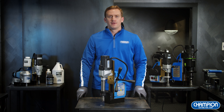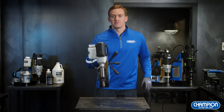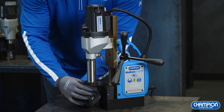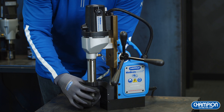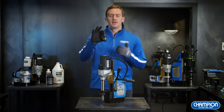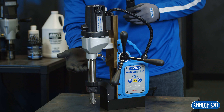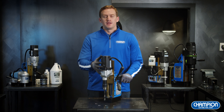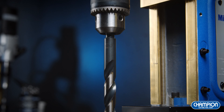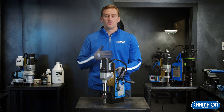Here we have our AC35. The AC35 is one of our best-selling units. It's economical and lightweight at 23 pounds, making it easy to transport around the job site. Another great feature is our Quick Change Arbor, which allows interchanging annular cutters quickly and easily. We also have a Drill Chuck Adapter available for the AC35, which can be used for twist drills and other cutting tools — simply remove the arbor and bracket. The AC35 has a drill capacity of 1-1/8 inch diameter by 2 inch depth, which is great for most jobs.